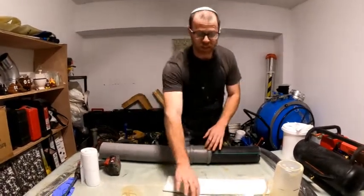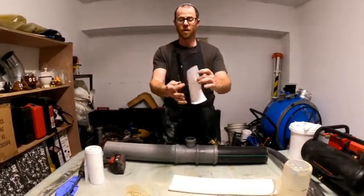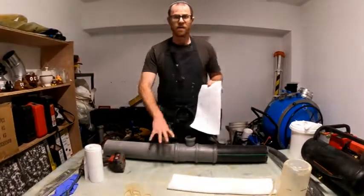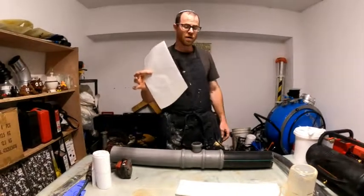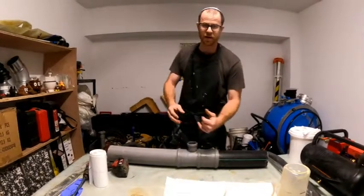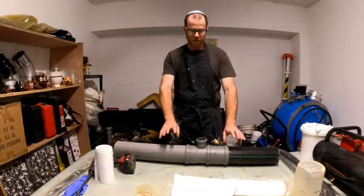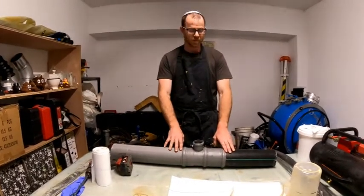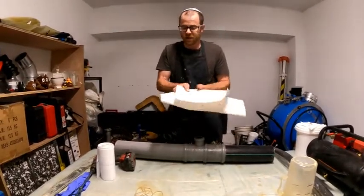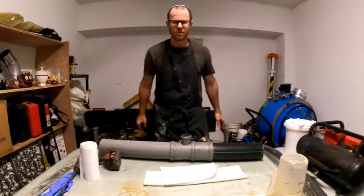What we're going to do is take a pre-liner — not a cal tube, but a pre-liner. It's very, very thin; it's meant for putting in a pipe before you line it, so it's a little bit larger than the inner diameter of our pipe. We're going to put a pre-liner over our patch and that's going to prevent the resin slug from penetrating inside, but it's thin enough and wide enough that the patch will press out and pack out into the pipe like it needs to. We're going to make it a little bit smaller than the patch, so the patch does adhere to the pipe at the two edges — about 10 centimeters on each side.